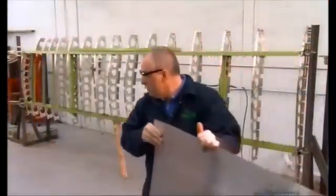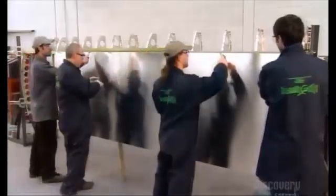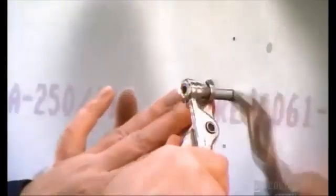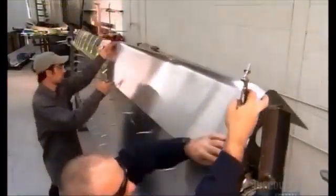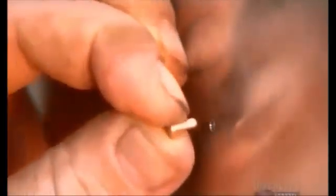The completed airframe now goes on a positioning rack to receive an aluminum covering called the wing skin. Workers use spring clamps to position the aluminum top skin onto the airframe, using the same procedure for the leading edge wing nose. Once everything is together with spring clamps, workers permanently rivet the assembly.